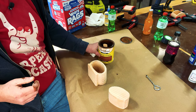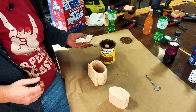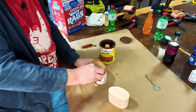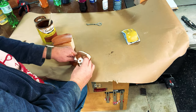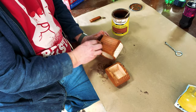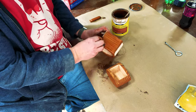For the stain I'm going to use a gunstock stain made by Varathane, applying it gently with a white rag on the surface of the box. By applying this stain you can see that those seams made from the kerf of the saw blade simply just disappear.